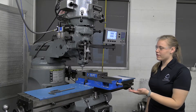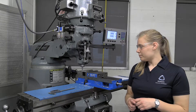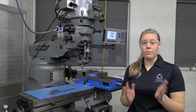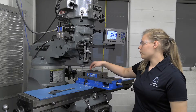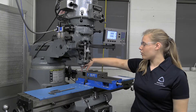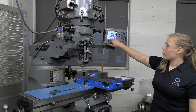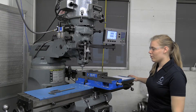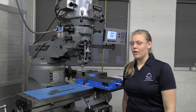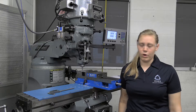What I currently have set up over here is a block — it's just over two inches long of aluminum. I've already faced off the saw cut side on the other side, flipped it over, and used an edge finder to measure how long this is. Now we have our DRO. We're over two inches and we want to cut it down to two inches. If I measure it with calipers, we're about 30–40 thou over our two inch mark.